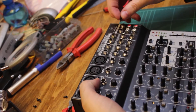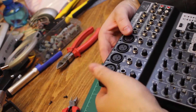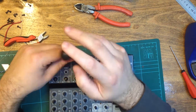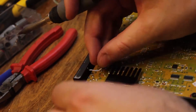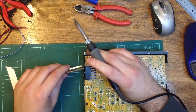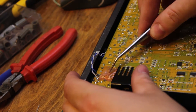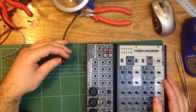I screwed back on a few more of the screws. With the top section screwed back on, I connected the wires coming off the switch to the PCB where the socket used to make contact. I also put down some double sided tape to both insulate the wires and to stick them down. Finally, I tested the new power switch to make sure that it was working as expected.